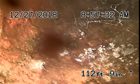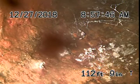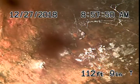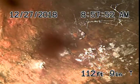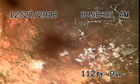We're here at 604 North Alpine Drive in Beverly Hills. The house is under construction and they're going to redo most of the stuff. We're probably going to recommend that you redo the plumbing pipes, because right now we're running the camera from the clean-out closest to the street in the gutted bathroom. It goes all the way through the house, outside to the back, until we've reached a point where we cannot push the camera any further.